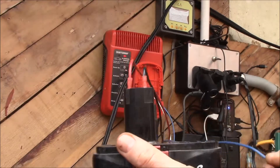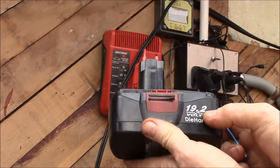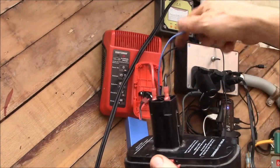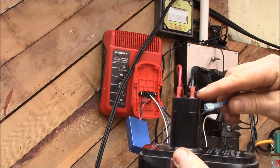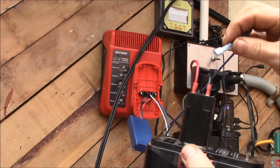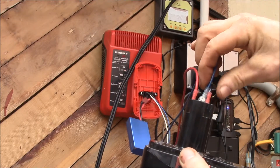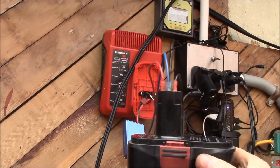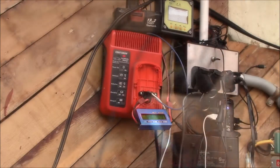For another experiment, I have a 19.2 volt NiCAD, and it does the same thing — you just get the flashing red light, which is the evaluate mode. But I noticed that all I need to do is plug in only the blue lead, and now I get charging.